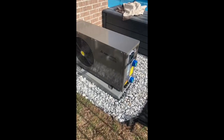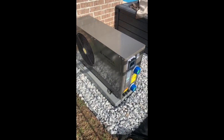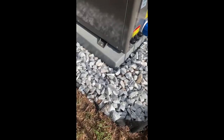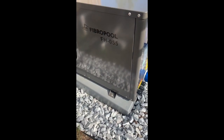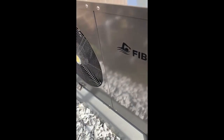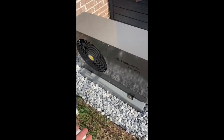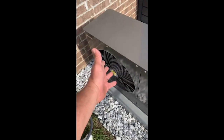We'll put our heater here. The pad is 18 inch by 38 inch by 4 inch. You can use a classic pad like this, or you can use two pieces of 16 by 16 by 4 inch thick concrete blocks — basically you need to put them right underneath the feet. The middle can be open. You need 12 inches all the way around and at least 36 inches in the front section, because this is the service panel and where the cold air blows out of the heater.